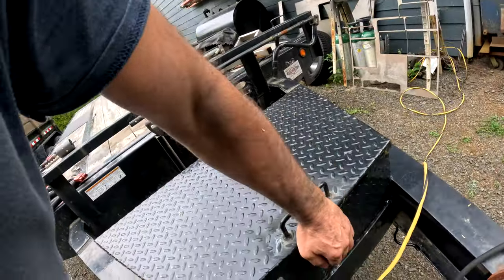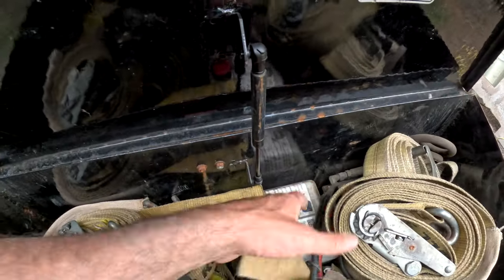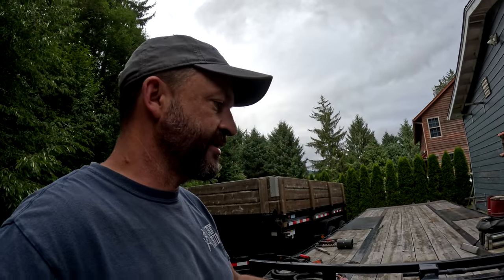One of my friends gave me this idea — he said, why not put a hydraulic winch motor on here instead of the electric one, because that'll never fail due to moisture intrusion. Unfortunately, I'd already ordered this winch motor and I'm not going to return it. But this is a hydraulic tilt deck trailer — I've got some hydraulic lines going back there and a hydraulic power pack inside the toolbox right here. There's no reason why I couldn't put a diverter on that, run a couple of extra lines out there, and use the pendant control to run the winch in and out. I actually really like that idea. So I think what I'll do is put this electric motor on here, and the next time it fails, I'll do the hydraulic conversion. A hydraulic motor is definitely going to be cheaper than the electric one, but I'll have to buy lines and a diverter valve, so that swap will cost more upfront — but it'll be the last time I do it.